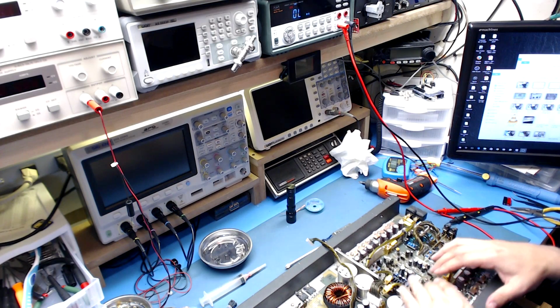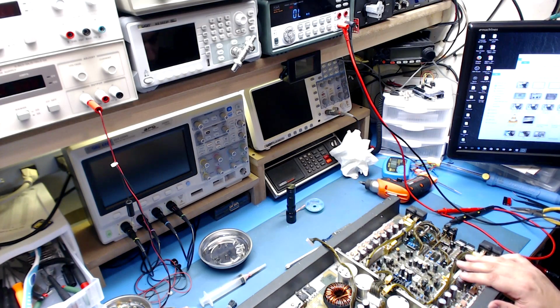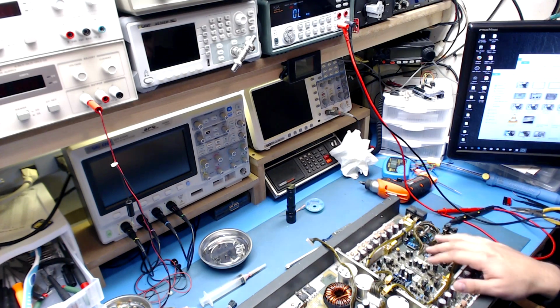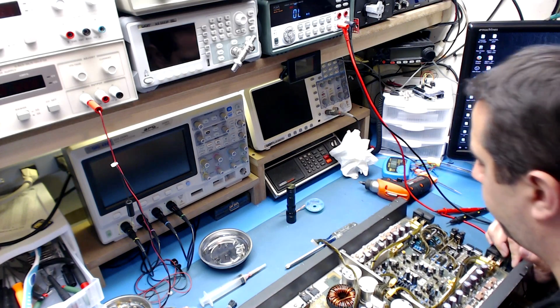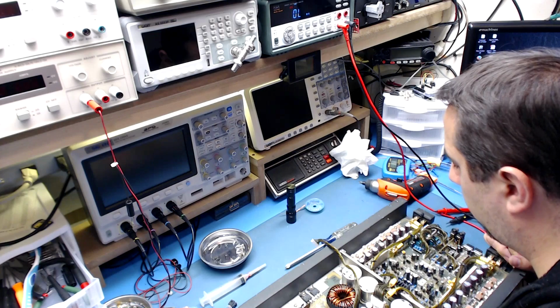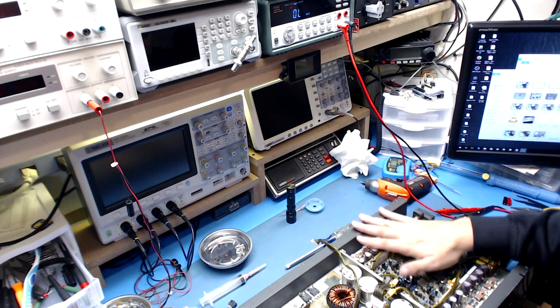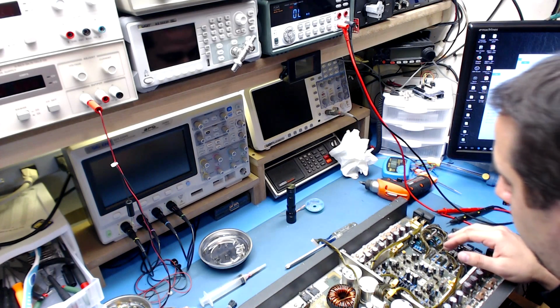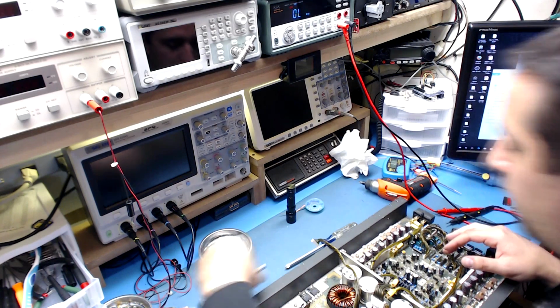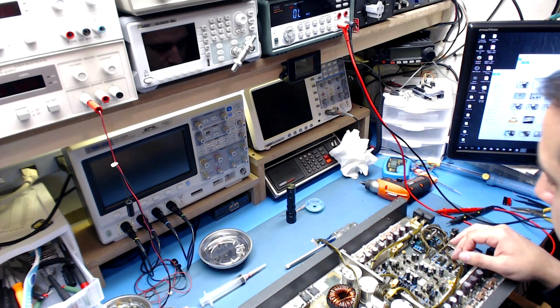All these FETs might be okay, so I might end up pulling all these out and seeing if the side of the channel is still swinging. But as for this side, we're definitely dealing with some issues on this channel. So, well, that's good though. At least we're finding some problems, and this basically told us where to look. Is pulled out components.